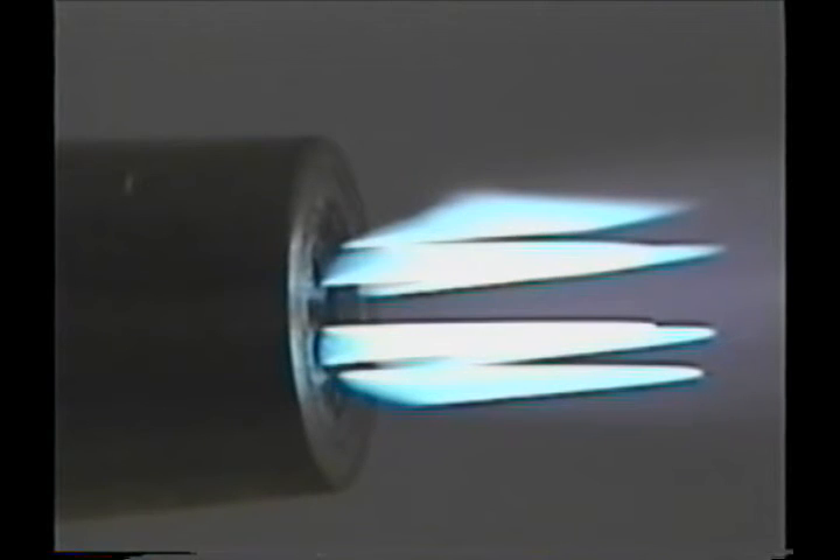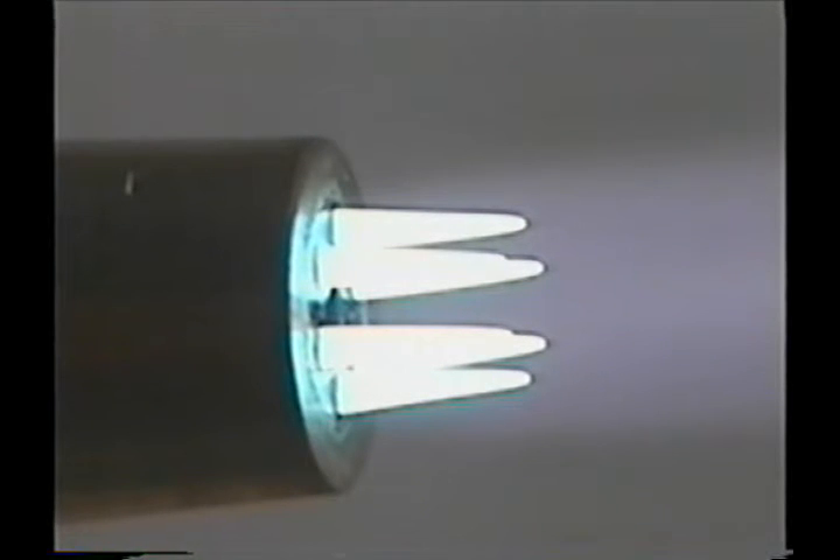While you're making the final adjustments, you can adjust the flame a little bigger or a little smaller depending on the situation, but you can't get too radical. If the flame is too small, it'll take forever to get the metal preheated and you may not have enough heat to sustain the cut — the flame may also pop out. If you try for too big a flame, you may not be able to adjust the preheat flames properly. But whatever the size tip or flame, always adjust it to a neutral flame.